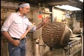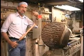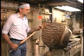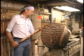I don't know if you could hear that, but as you start to get closer to round, the sound that the lathe makes as it comes around, that sort of ripping sound of the cut, gets longer as a percentage of the turn. Then you know you're getting a little further down and less choppy.